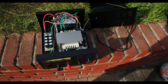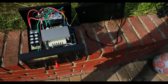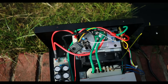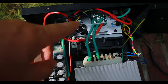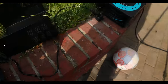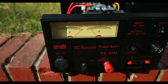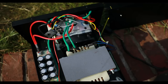The modification is very simple. If you have a slow constant airflow, everything stays cool and the fan will not even need to start. It's very simple — one transistor. Let me focus on it — one transistor and one adjustable resistor, a potentiometer. That's all you need. Now let me plug it in — we have probably 12 volts there. Look at the fan — you can see the fan is spinning.